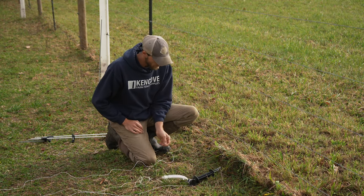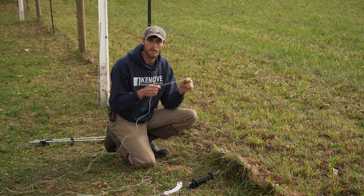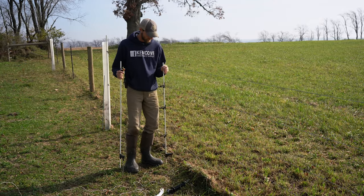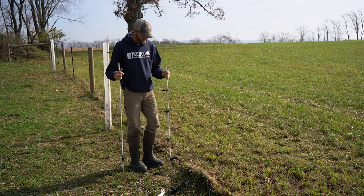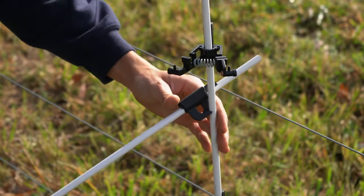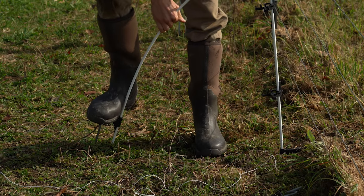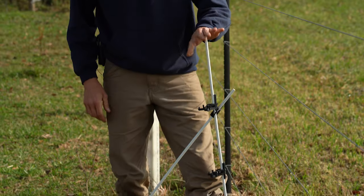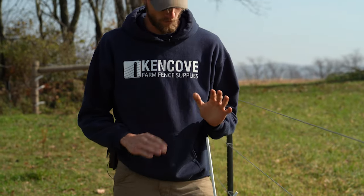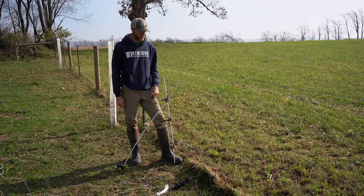Lastly, we can use a KiwiTek release hook with just a bare end of twine to connect to our fence. There are two ways to use KiwiTek release hooks to attach our open end of twine to an existing fence or to start our run. The first way is by assembling and installing a brace — here we have a vertical post with our release hooks and a diagonal brace. We covered KiwiTek posts in our other video so check that out if you need a refresher. Now we're ready to attach our twine.